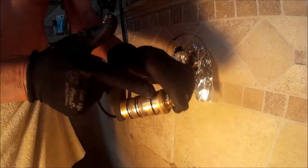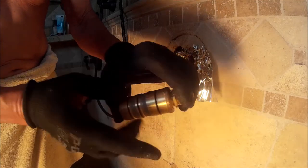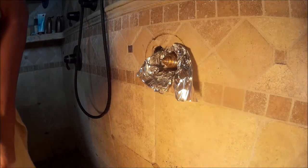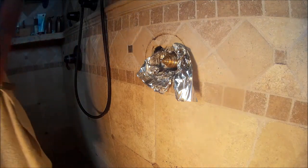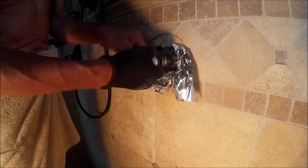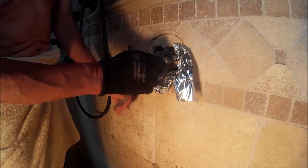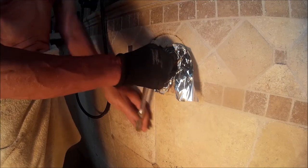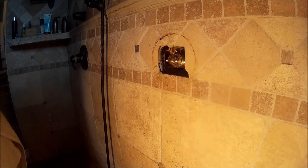So I've put a generous serving of this paste on all the O-rings and the threads, and then I slide it in and tighten it. Now, this is where I said that they got this thing right on the new cartridge. When you're screwing in the main cartridge body, all of a sudden you get to the end and then you keep screwing and you start to loosen the inner part of the cartridge, which is the part that's got the nut on it, which is a little bewildering.